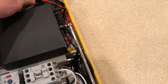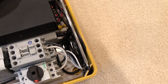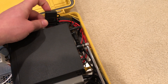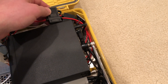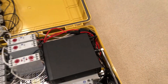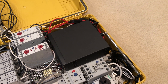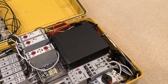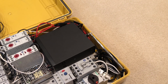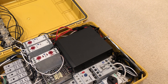These have just a standard one amp blade fuse in there. That's all the DTMF-8 plus's relays can handle — one amp. Since wiring this properly, I haven't had any issues with fuses blowing out. But just as a precaution, I would put those fuses in there. They're five cents a piece versus however much money you're going to have to spend sending it back to Intuitive Circuits to get it fixed like I did.